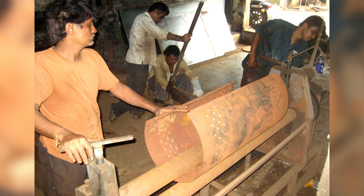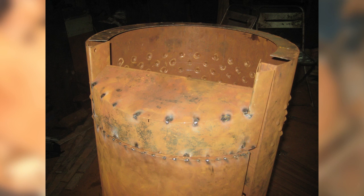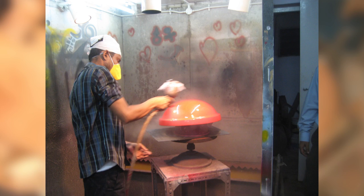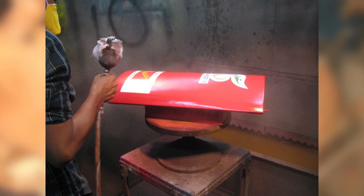So they rolled. That's a rolling machine on which you roll your sheet. Then you do all the fabrication by welding. All the surfaces are welded together. Then you do the painting. We did the painting processes, painted them after treatment so that there's no rusting inside. And then we did the top, the round top. We've learned our lesson. So we did the hinges, the doors, the details, pretty tough.